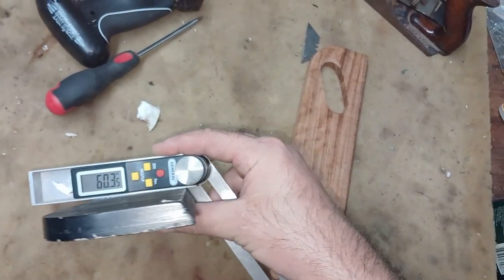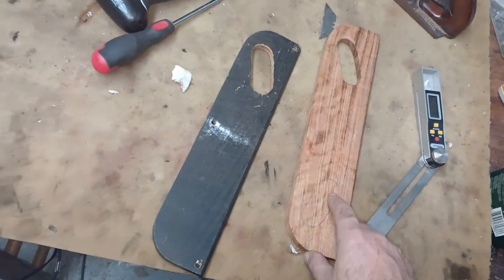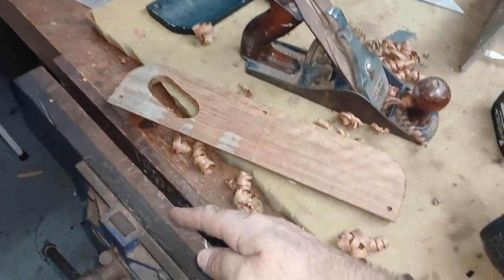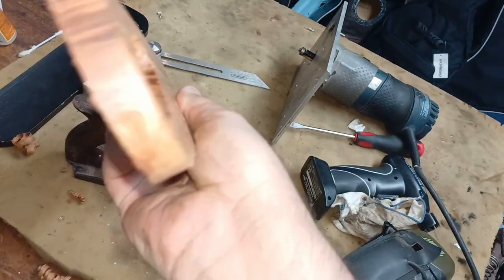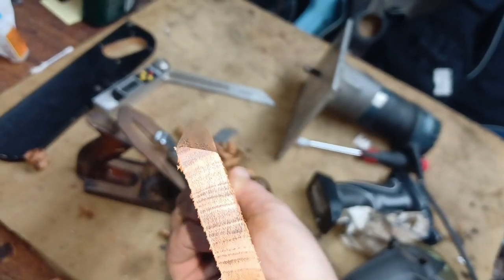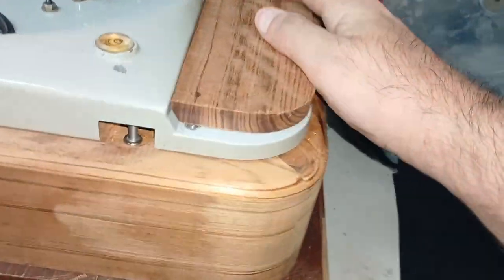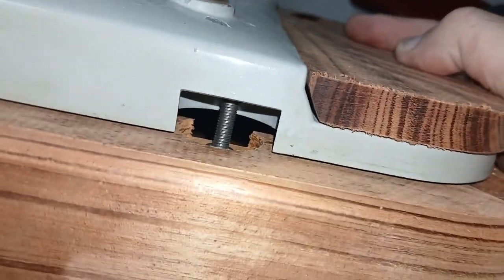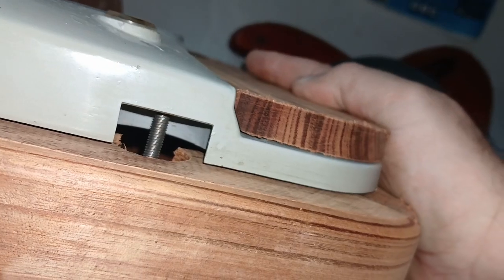So as I say, there's many different ways to do that cut. It could be done on the table saw, the jointer, the router. Could just be done by hand. Right, so I had that upright in the vise, and I plane that edge, right, to 60 degrees, just measuring it back and forth, of course. But of course, the real test is to come over here to the chassis, and we see we got it just right. Just perfect, right? I got it, yeah.